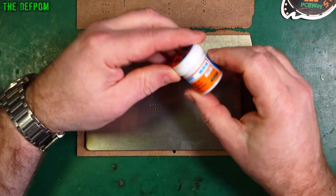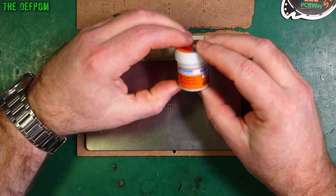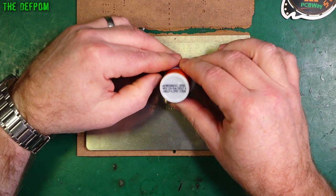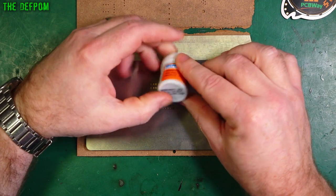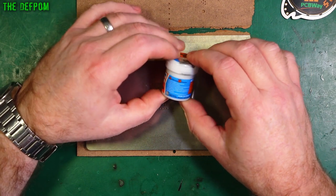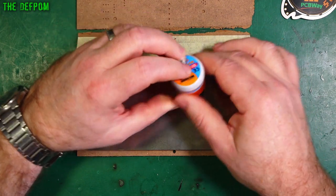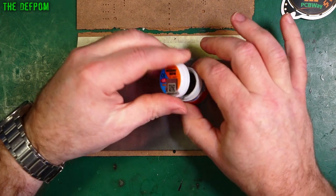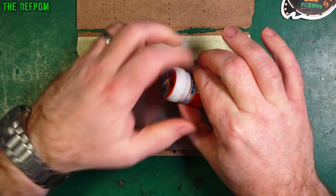When I did this before I used this old mechanic solder paste, which I think was okay when I first got it, but unfortunately it's kind of expired and I had trouble with it last time — it was causing bridges, and I had to reseat all the components afterwards. So I'm not going to use this again. It's going a bit crusty inside; the middle bit's still okay but outside that it's all rock solid. I'm going to chuck this one away.